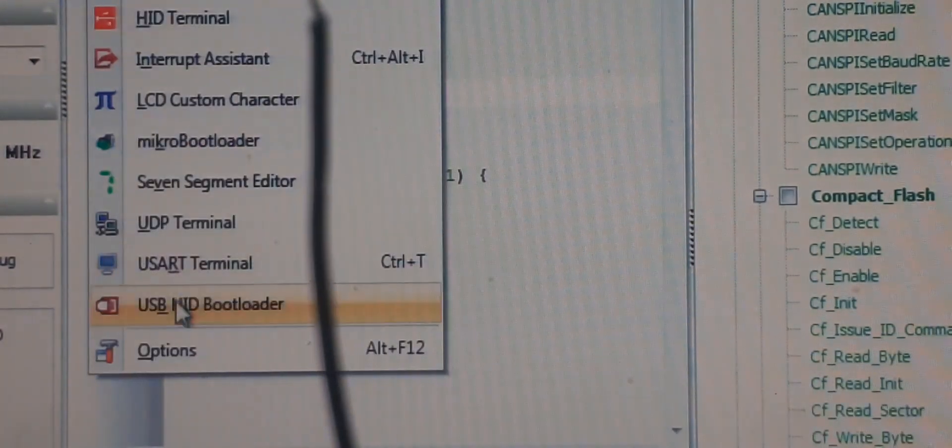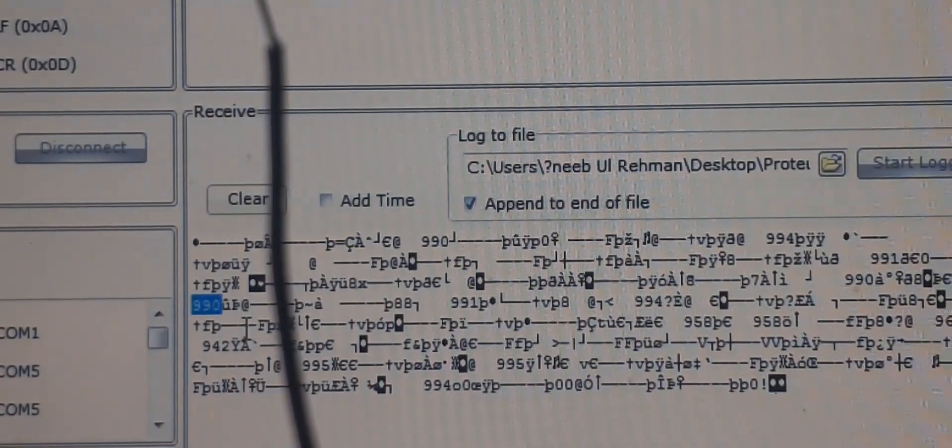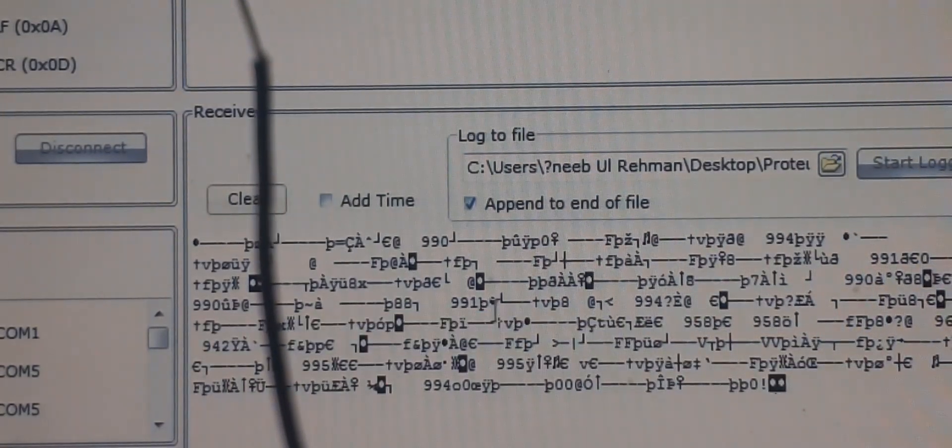The way to handle this noise in your code is to filter by value — for example, if the reading is greater than 990, turn on the bulb; turn it off otherwise. The rest of the noise values will simply be ignored. There is also a comparator IC on the receiver module that helps pass only the intended signal through.